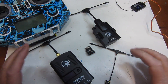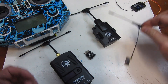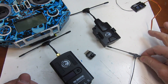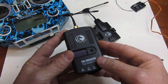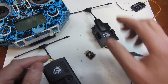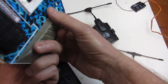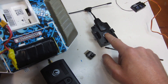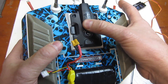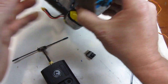Thanks for hanging around guys. Let's go ahead and cover some basics first — what parts are we going to need to get this working? Obviously you're going to need a receiver. This is a Crossfire Nano receiver, and it comes with an Immortal T antenna. You're also going to need a module to put in your radio. This is the TX Lite, and this is the TX Micro — it's a little bit cheaper. There are other modules available for different radios. I'm using a QX7, which takes a full-size module. You simply plug the module into the back of your radio, and it snaps in, allowing the radio to use that module to talk to the receiver.